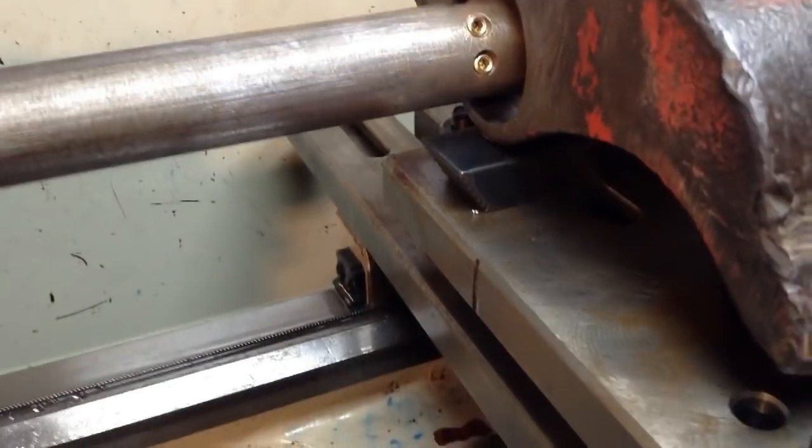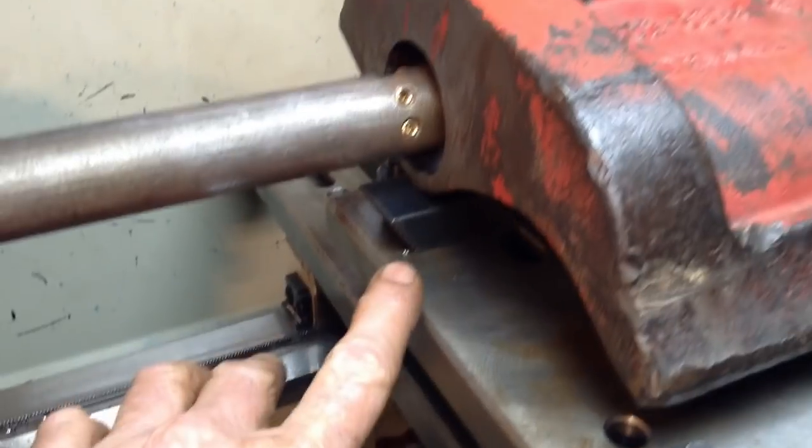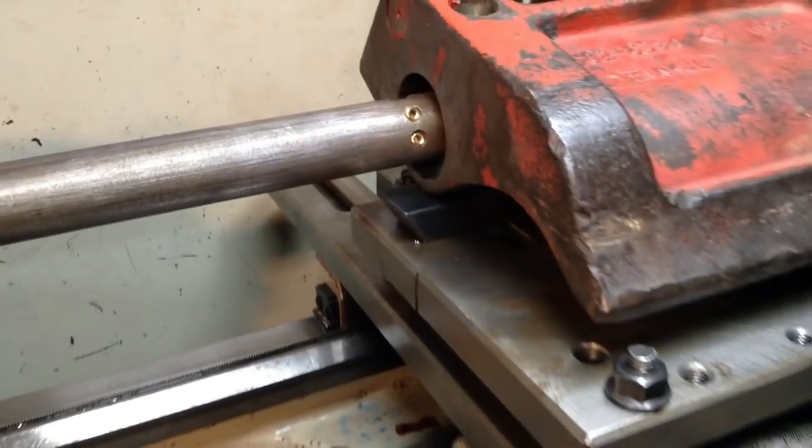So we've got three options to put a tool in this boring bar. It takes a 5/16 square tool and two grub screws on the top to lock the tool in place. When I made this boring bar I do have the holes offset, so the top of the square is just a bit above centre height — when I grind my tool I do not have to take much off the top of the tool blank for the tool to be on centre, and I find that works quite well. It's just a matter of picking a location and keeping the length of our bar as short as possible. We'll use that location — that will allow us to do that bore. The next hole along we're heading out to the chuck, so we'll slide the boring bar out a little bit until we have good clearance at the end. We're clear at the chuck at the other end. I'll go and find a tool and we'll put a trial cut through. Earlier on in the setup I did switch the parallels that we had underneath here just for a straight clamp, as the parallels were sticking out too far and I thought it might interfere with the chuck.